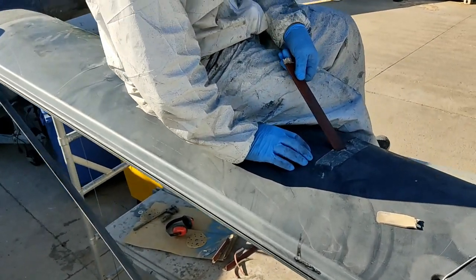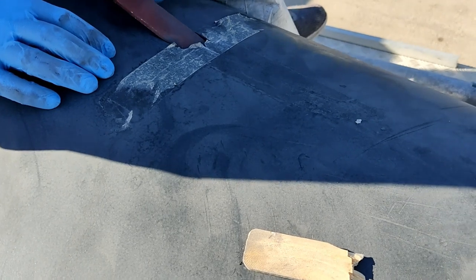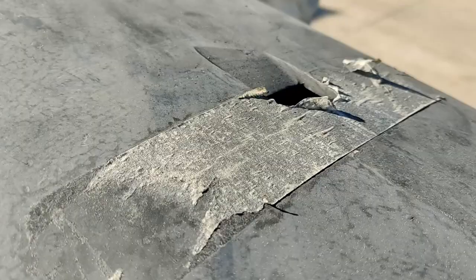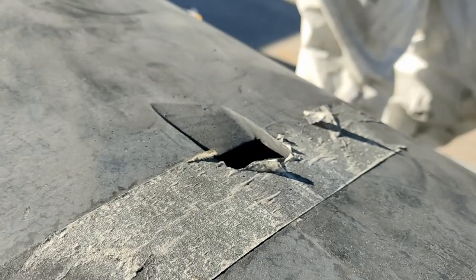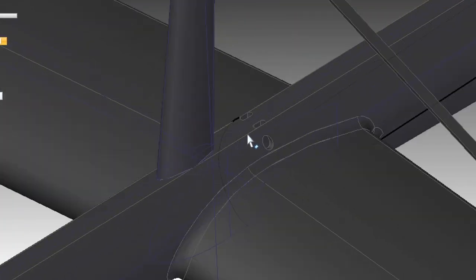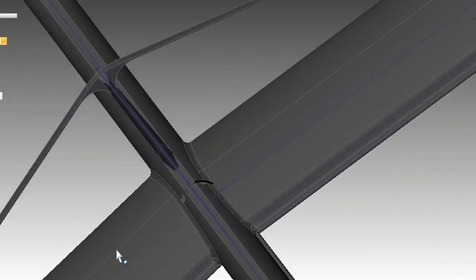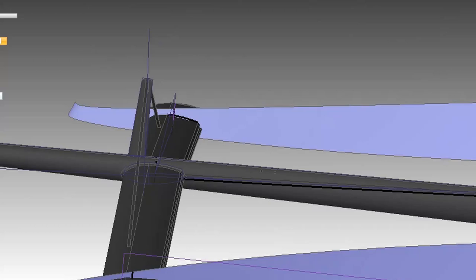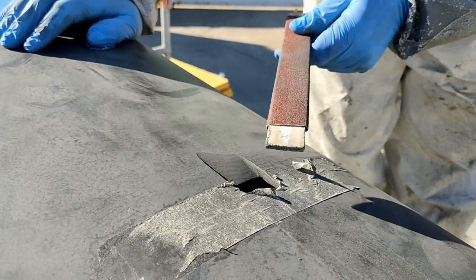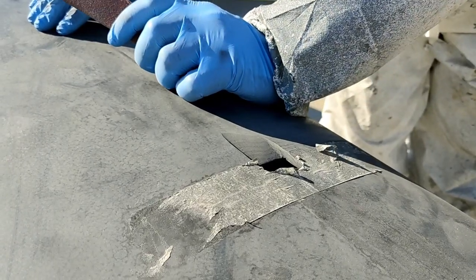This is the penetration hole in the top of the beam where the martingale strap is. Lots and lots of measuring, drawing and CAD modelling trying to get this slot in the correct position — so I know where the penetration is, how big the slot should be, and the approximate angle so that when I cut it, my slot is not crazy oversized.